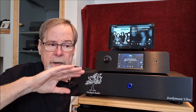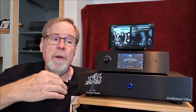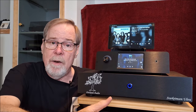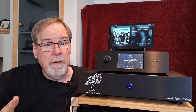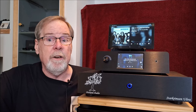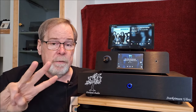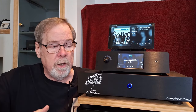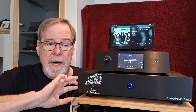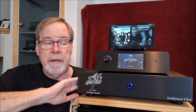Once music in its digital format is converted to analog, we measure analog signals in frequency - alternating current between 20 Hz and 20,000 Hz - and you measure alternating current in amps. So a current-design DAC can carry more power and needs far less amplification to get the signal up to two volts single-ended or four volts balanced. With this, Leo uses the TI OPA1612 op amps, which are really, really good and high precision - and that's plenty of power to drive the single-ended and balanced outputs.